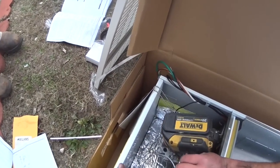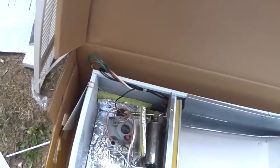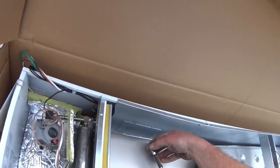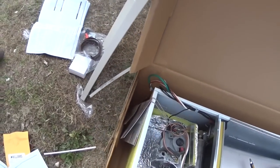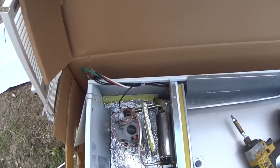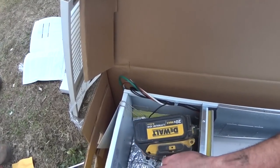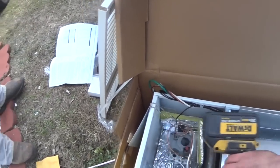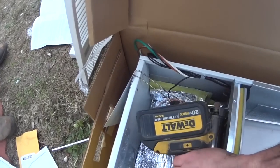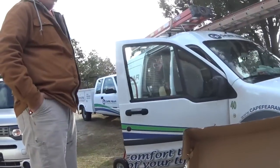and then after it ran for a minute, the voltage jumped up to the 26 that you usually see, and everything was fine. But after I noticed and started looking at that, I couldn't get it to do it again while I was checking inducer pressure and voltage, so I could see if my assumption was correct. And as soon as I closed it up, it dropped out again.